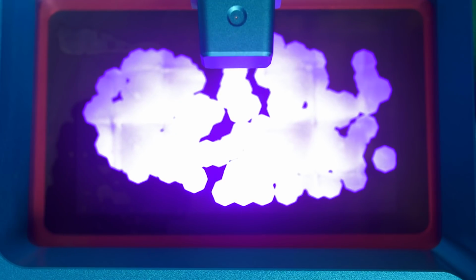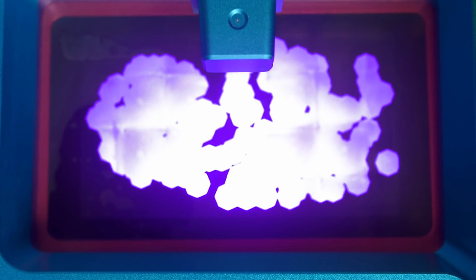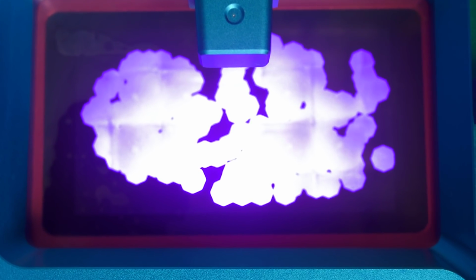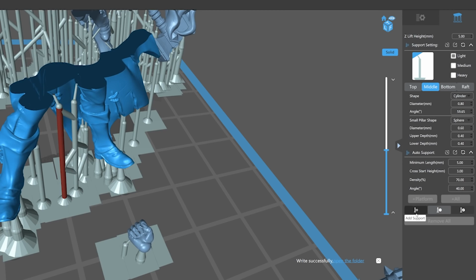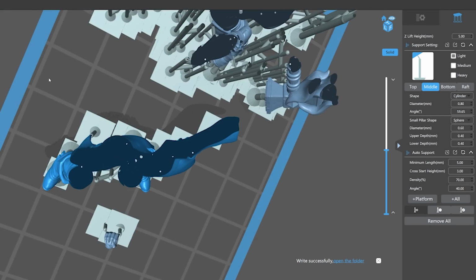There are two major factors in 3D printing that will affect your printing fidelity. The first one is your exposure settings. Each layer of your miniature is exposed to UV light, partially curing it. If you expose it for too long or too little, you stand to lose detail. The next important factor when considering high quality resin prints is supports. Where you place them and how you orient your model on the build plate are all things that will drastically affect the end result of your resin print.